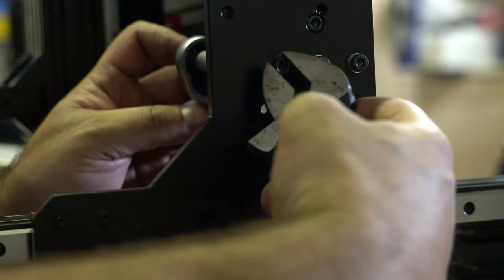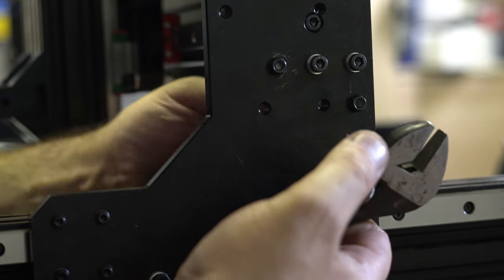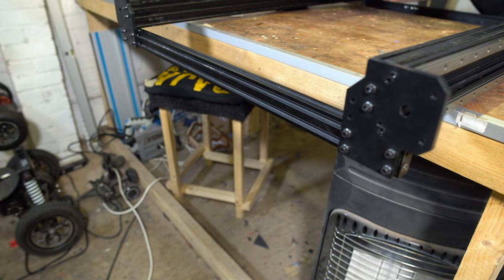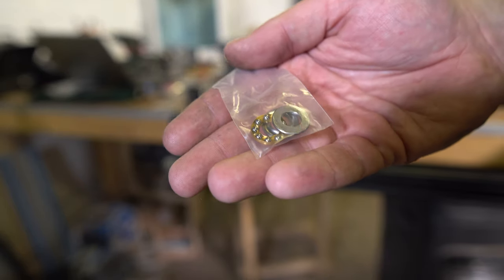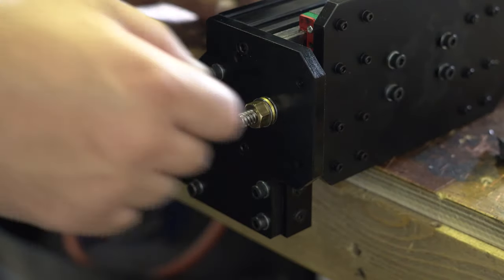It's worth noting that Rat Rig only use full cap head bolts throughout — the WorkBee uses a lot of low profile headed bolts even where they don't need to be. With a proper full-size head you can get a lot more torque on the bolts with confidence and bolt it all together much more rigidly. After that I put the beam end caps on, stuck the Y cross braces on the front and back, and moved on to assembling the motors and lead screws. This is another area where Rat Rig have improved the design — they've got rid of the old bearings and use thrust bearings instead. You wind on a nut to tension the whole system up, screw in the grub screw, and it holds everything super tense — much nicer than the old drop-in bearings.